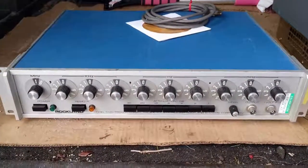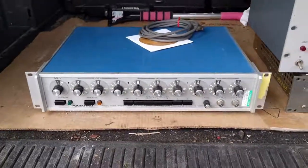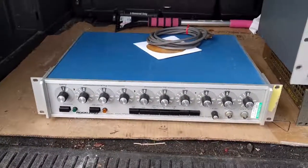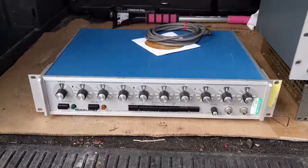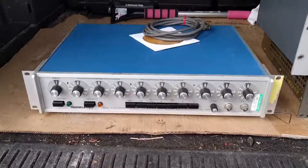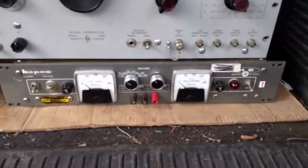Meanwhile, here we have this Rockland 5100 signal generator. This is going to be great for testing audio circuitry. This hits the low end of the frequency spectrum, you know, down where you make notes from a guitar or any other electrical instrument. So this will simulate a signal, a sine wave, going through an audio circuit. And this is just going to be awesome to work with for testing amplifiers. And then finally, the DC power supply.